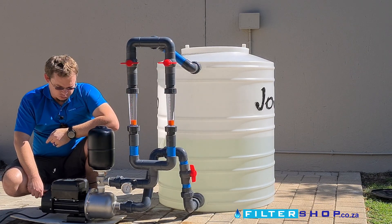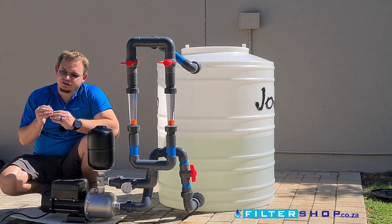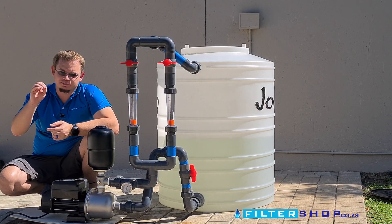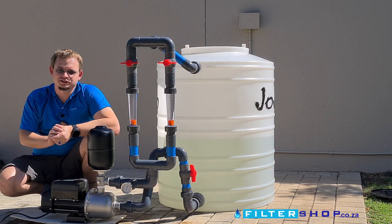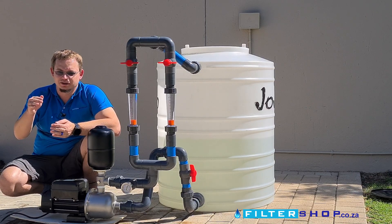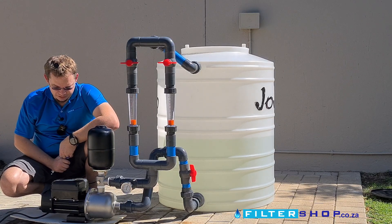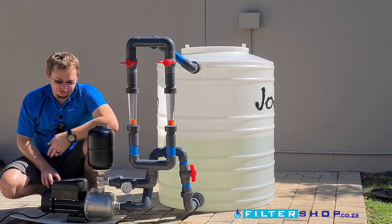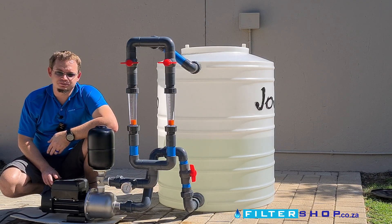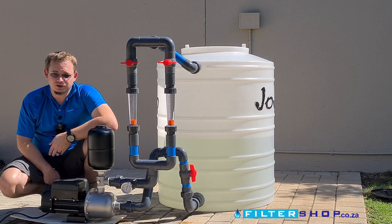Overall conclusions: it looks like a nice pump. At maximum volume it's actually very quiet, but the pitch is a little higher than you'd have on a multi-stage pump. A multi-stage pump like the HMS would be similar but maybe a little louder at a lower frequency, whereas this has more of a higher-pitched hum. Power consumption is not bad overall — actually very good for the amount of water pumped through — but it does use a little bit more especially at lower flow than a multi-stage pump. If you've got a higher flow application, this overall looks like a very good option.